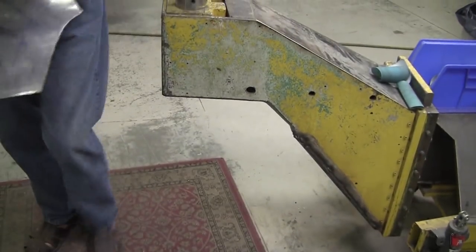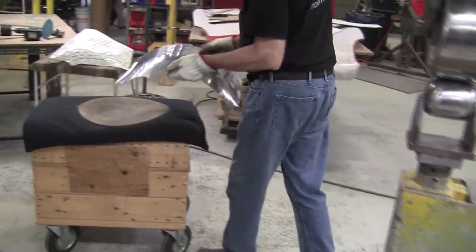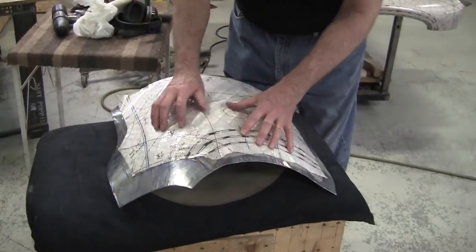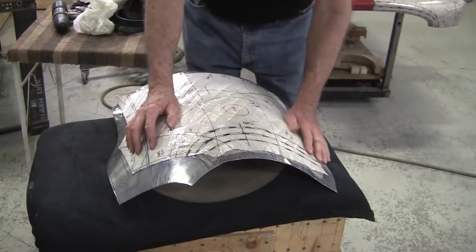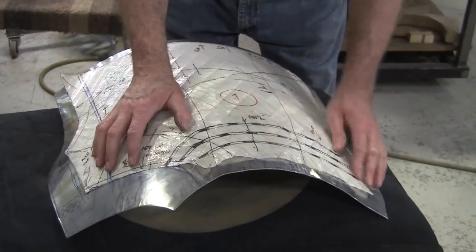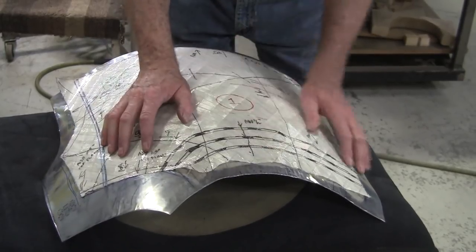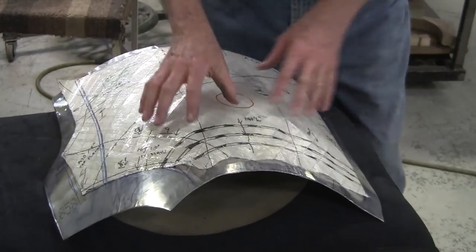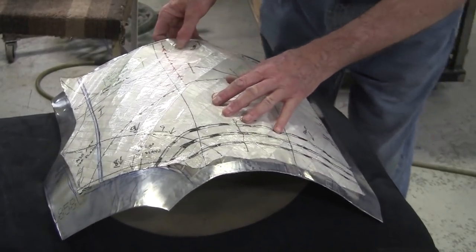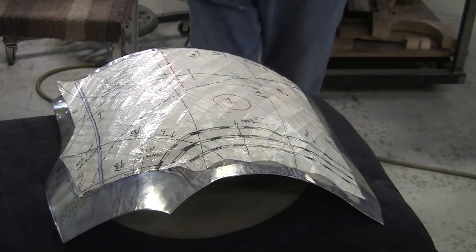Let's see what the flexible shape pattern says at this point. We've got the panel stabilized and the residue from malleting is gone. We put it on — it's better than I thought. It's fitting pretty nicely over here; there's about almost a quarter of an inch gap in one area, less over there, and almost nothing here. We always go to the worst spot first. I need to make sure I get my perimeter marks on here — the magic marker fades out when you wheel it.